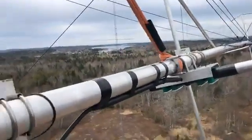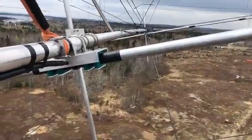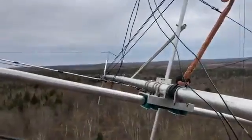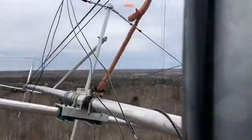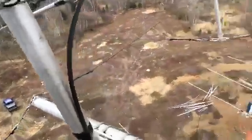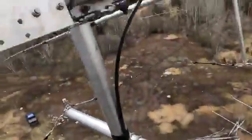With a 700-pound antenna — maybe 750, we calculate around that weight. This is a three-inch boom; the elements are two-inch, three-inch boom, two-inch elements, and they're custom built — this is a homebrew yagi. It's very large. If you want to play with the big boys, you've got to do big and dangerous stuff.